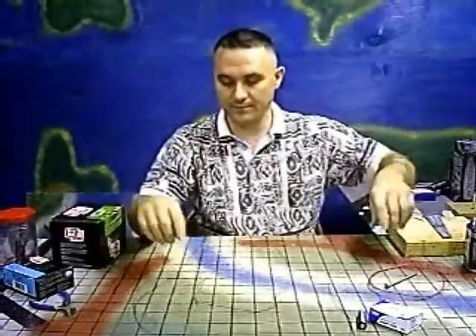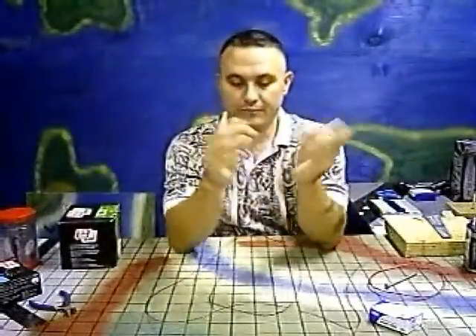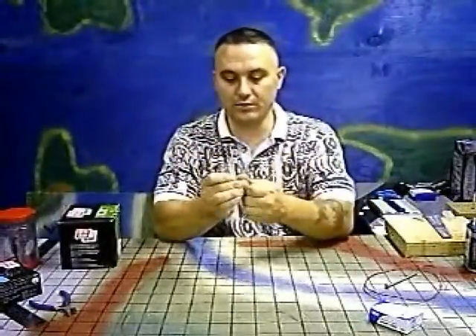The first thing I'm going to go over is the basic theory of electromagnetism. What that means is wherever you have a flow of electricity, you also have a magnetic field. So if I were to take this piece of wire and run a current through it with my battery, it will create a magnetic field around this piece of wire. It's a very weak field because you're only going through one strand, but if I made a loop in this wire I would double the strength of the magnetic field.